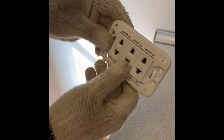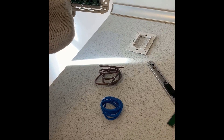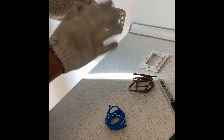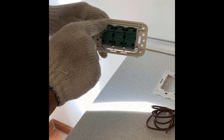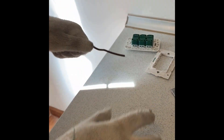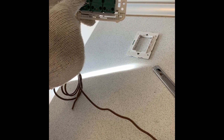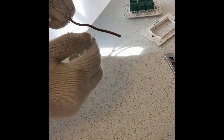You can test the firmness of each receptacle by pushing it with your finger — when you plug in your device, it should not bend. Now, the first thing to do is connect the receptacles together using live and neutral wire. When complete, this will be like a parallel circuit. Make sure there is no contact between the live and the neutral. We're going to cut the live wire into smaller pieces — one piece to join the first receptacle to the second, and another small piece to join the second to the third. I recommend cutting the wire to about six centimeters in length.